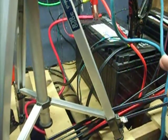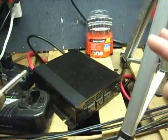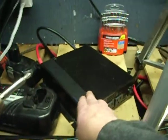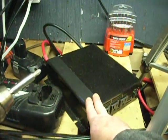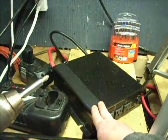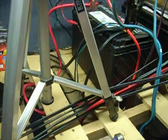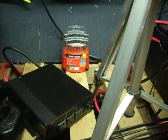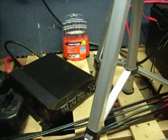And then a 48 volt battery bank is half of that again — half of 75 amps. That's how I kind of roughly figure out real quick in my head. So if I plug something in here that's drawing 500 watts, then I know that I'm only drawing about 50 amps off of my batteries roughly. That's my little easy mathematics so that I can have a quick understanding.